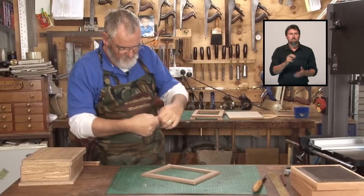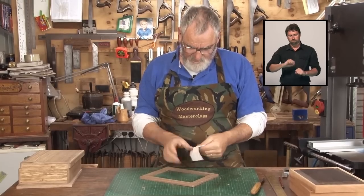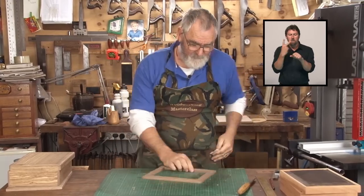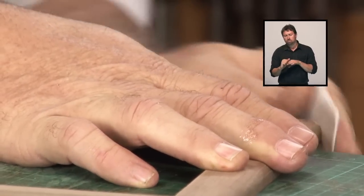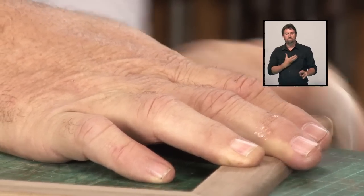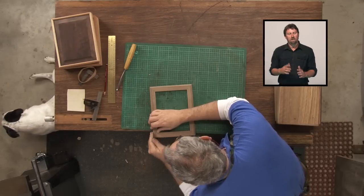So I love using Australian furniture grade timber species because they're nice and soft. Better than blue gum or spotted gum or whatever. So I use a lot of 180. And then you just round them over. It really gives it a nice soft appearance. Doesn't take much. Just adds that extra little bit of class.